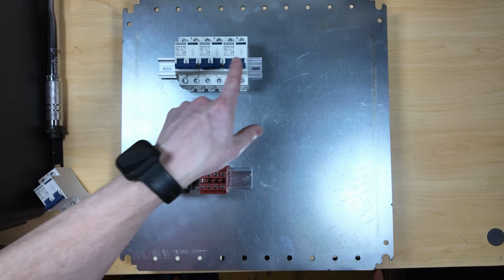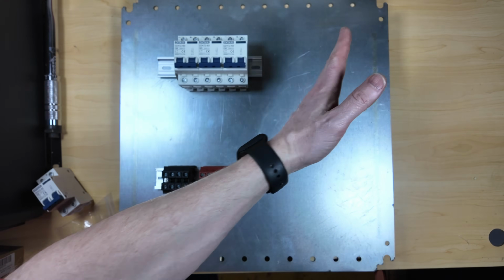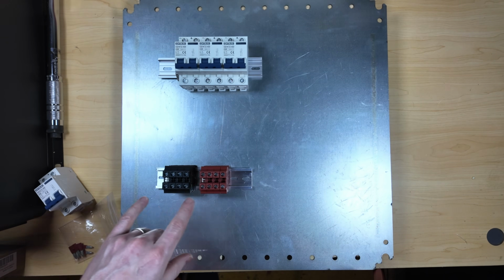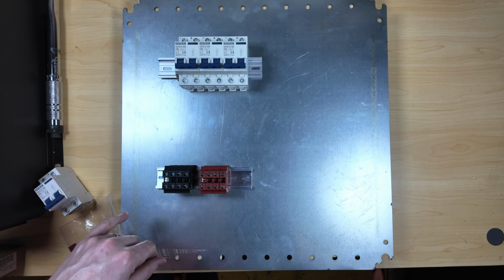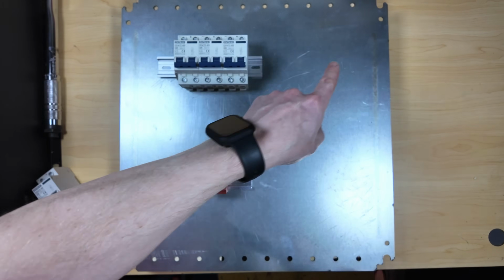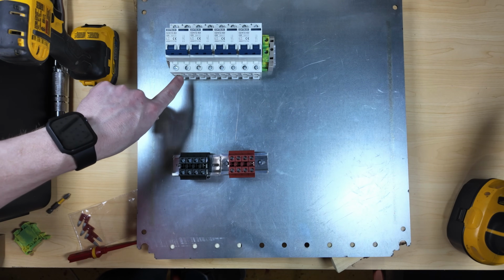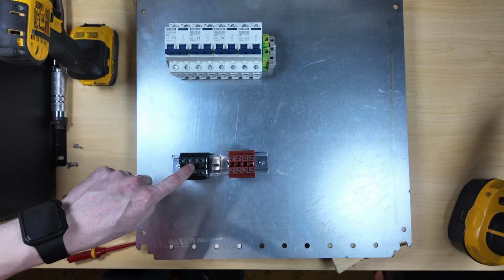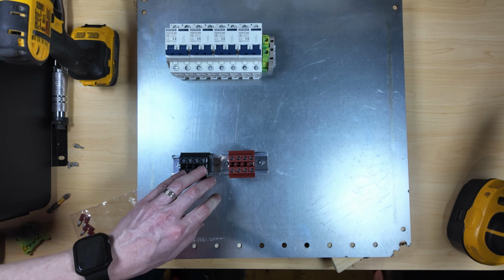And I know that I'm going to need another bus bar once I get those 4 SPDs, so we'll end up lengthening that out as well. I'll need some more Dinkle DIN rail connectors as well for those SPDs, just so that I can bridge the connectors and run them over to the SPD. So the next thing we'll do, we'll make our little pigtail loops coming from the bottom of the breaker, coming to the Dinkle DIN rails.